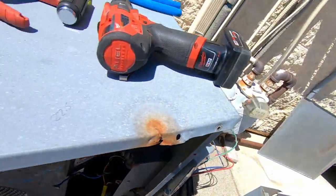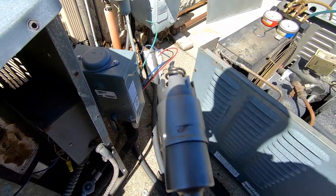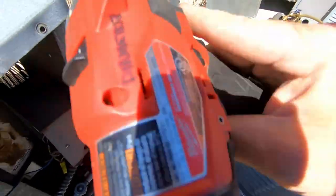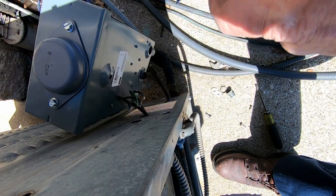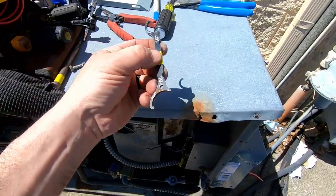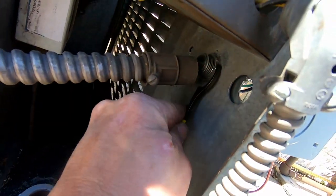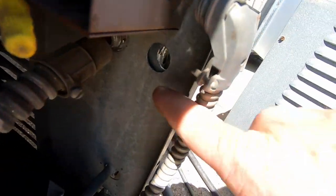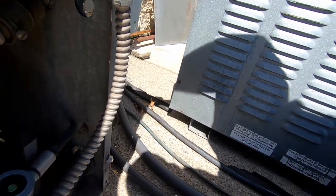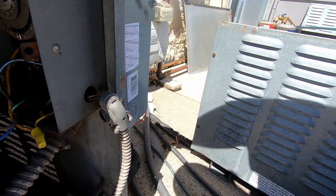Since this hole lines up with that hole, I'm going to drill it out and just rerun that wire over there. They've got all their little couplings in here — it's a total wreck the way they did it, a lot of extra work. Makes a 10-minute job turn into 20 to 30 minutes. Got the old Greenlee quick cutter here — you can set it and change whatever size you want, it's carbide-tipped. Get that thing drilled out. The way it's designed it doesn't allow it to go all the way in and hit the wire behind it. That little wrench came in handy in tight spots where you can't get in there with a screwdriver.